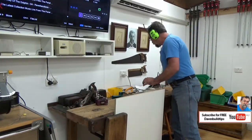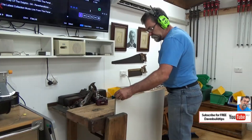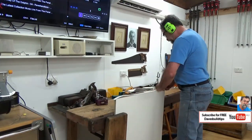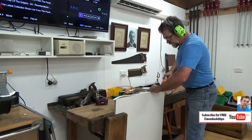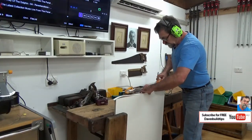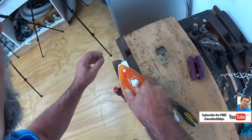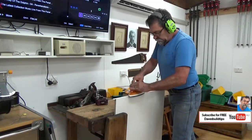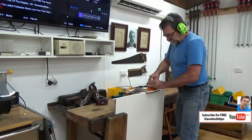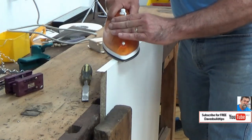So I have a long side here. I'll get a piece of melamine strip. I've cut the board on the saw — nice, plain cut. Just tear off a little bit of the soft glued iron-on plastic that goes on the edge of the melamine. I've got the iron turned as hot as it will go. It's a clean iron, so it doesn't really need to have any brown paper put on it. Now just make sure that the iron is dead flat as I pass it over the top, and I don't go too fast. The whole idea is to heat the whole thing up.